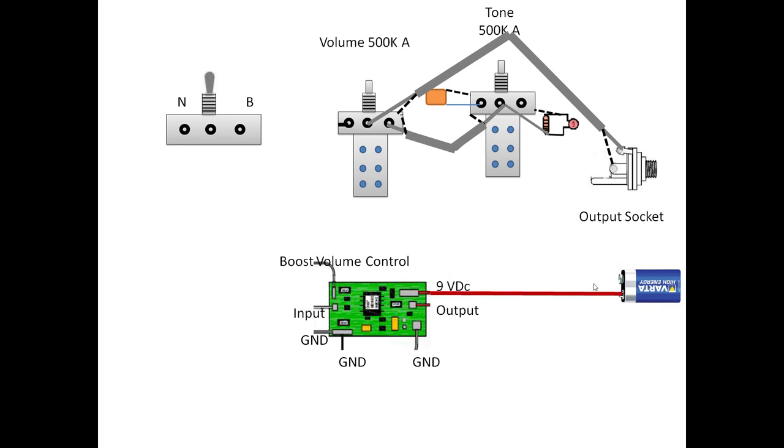Connect the 9V battery, then start connecting ground throughout the circuit. Take one ground from the tremolo to the selector switch, then connect one to the volume — volume to tone is already connected through this point — and from volume to the output socket. We already have ground at the output socket, then ground to the battery, and ground to the boost circuit. There are many ways to do this upgrade; I'll show some of them. This is exactly how my guitar is at the moment — the first idea that came to mind, not perfect but working fine for about a year.